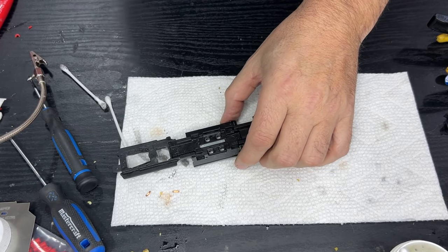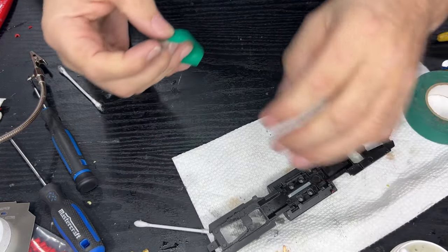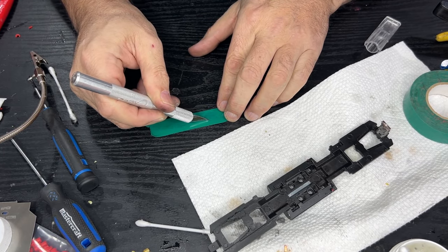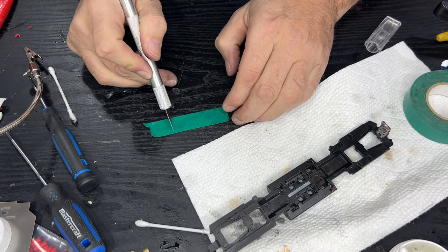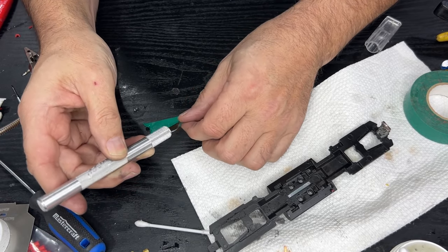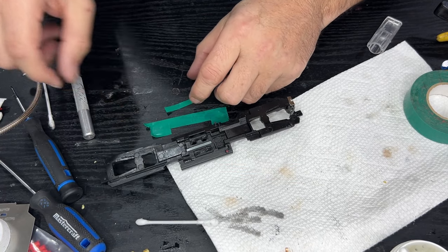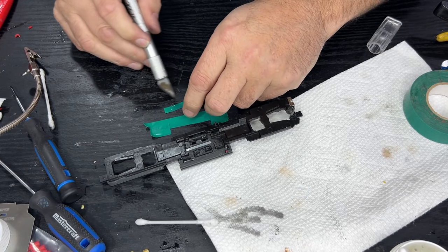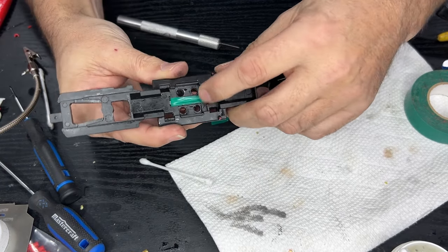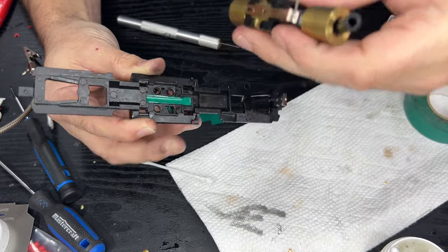Let's get a bit of tape and cut this to shape - just a very small strip. You can't use the whole width because that would cover up your installation holes. Like so - no danger of the motor making any connection from that bar down to the frame. So the motor can go back in. We have to see if these little 3D printed motor mounts are going to work. One in that side, one in this side - there's still bits of old motor mount material in there. Push this into place - that way around - and that should pop into place with a bit of force.